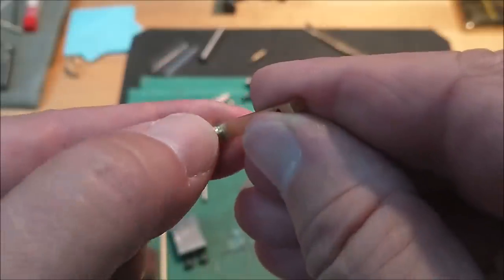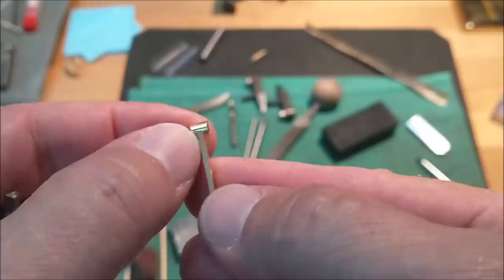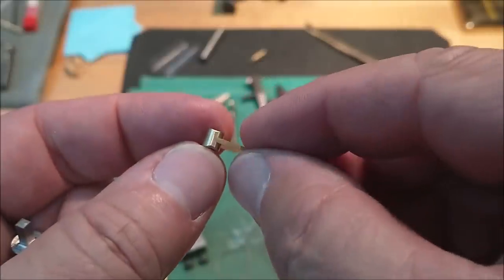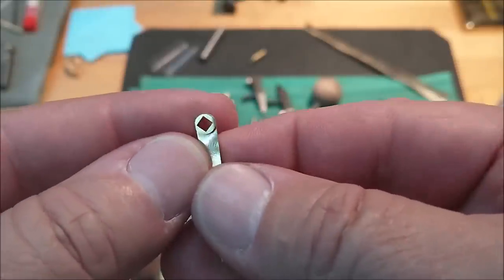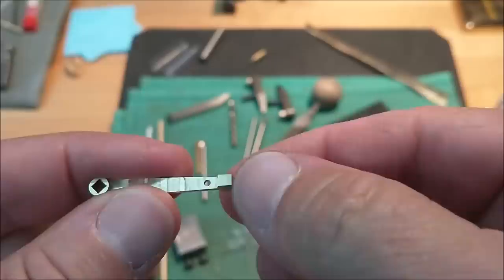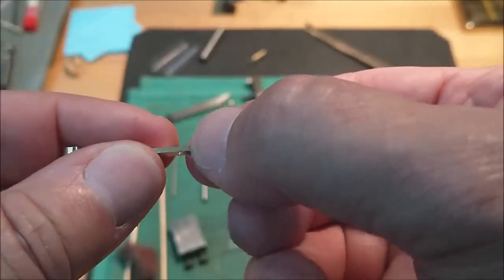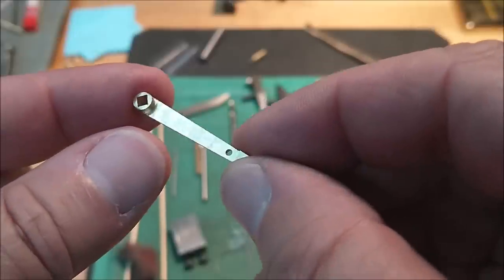And the trick of making the inner radius bigger than the outer radius is a real good one, because if you didn't do that, you risk the possibility of having a line this wide around your part. So with the back radius being tighter, it erases it, and you really can't tell the difference. So once the top edge is all deburred, and this is all deburred, I'm going to saw this off. Blend that hole in, because I just don't trust that cross section right there with an end mill biting all this material off. I think it would lift it. So that'll be next.